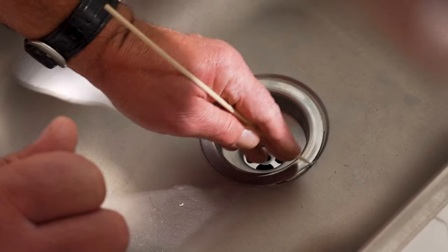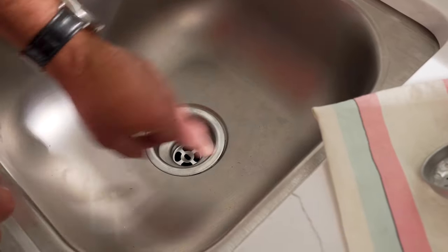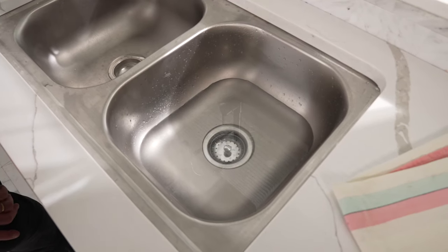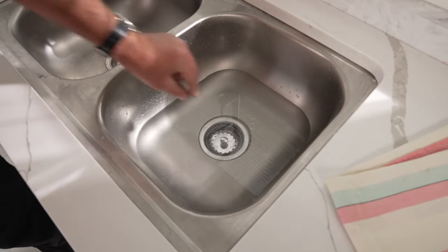You may notice that even after you use the sink a little bit, more of it comes up. What I would do to test and make sure it doesn't leak is put this in, put a couple inches of water in the sink, let it hold there, look underneath, and check the connection. But that's once all the drain assembly is put together, and that's it.